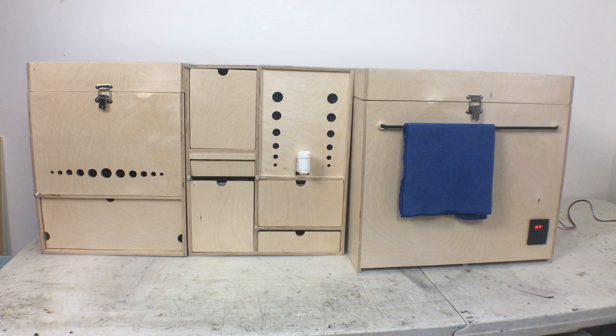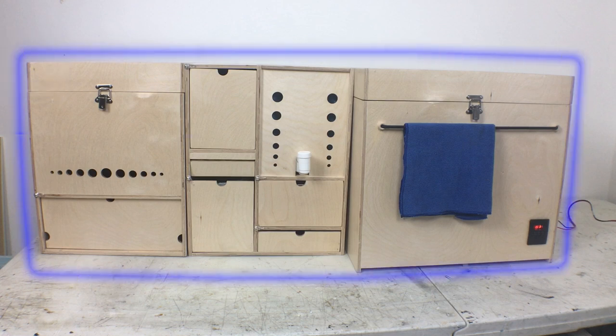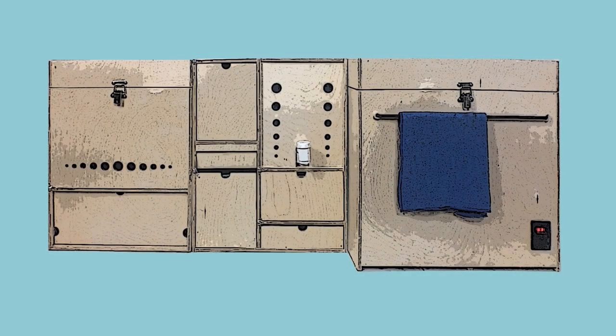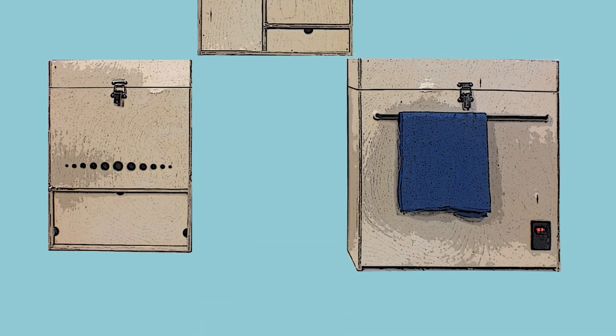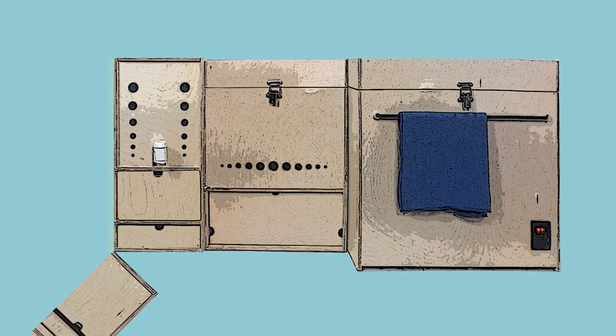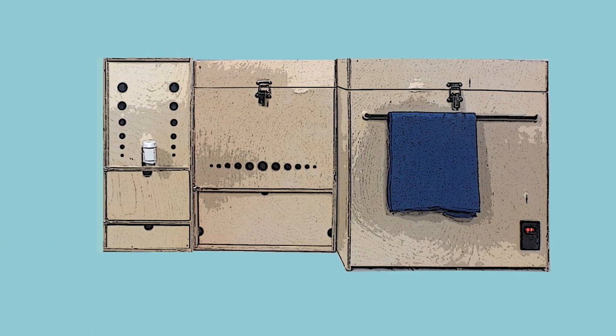So what to do? The problem areas were the pantry box, which could not open because of the way the opening narrows. The whole thing was just too wide, so one of the sections will have to go. The only part of the kitchen that could easily be changed was the garbage compartment, so that is the one that had to go. And the cooler on the other side can't open either. To solve the pantry box's problem, I moved it to the middle of the shelf. I took the garbage compartment back to the workshop and cut the whole thing off on the table saw. I couldn't move the cooler much because of the vents on the right-hand side, but I could scooch it over a bit.